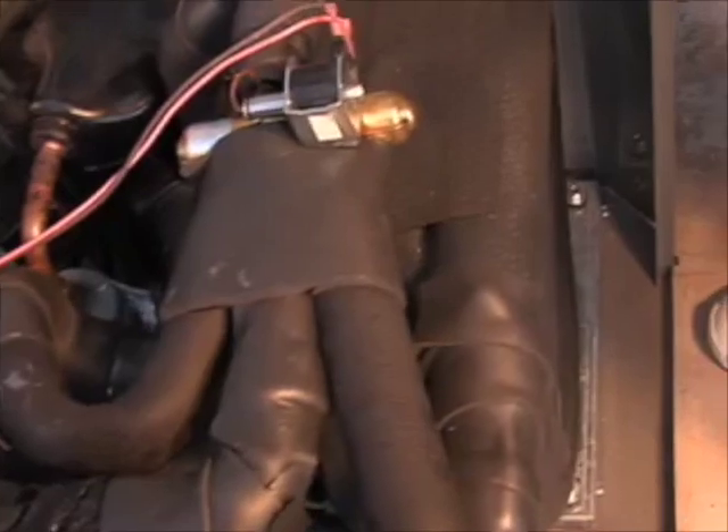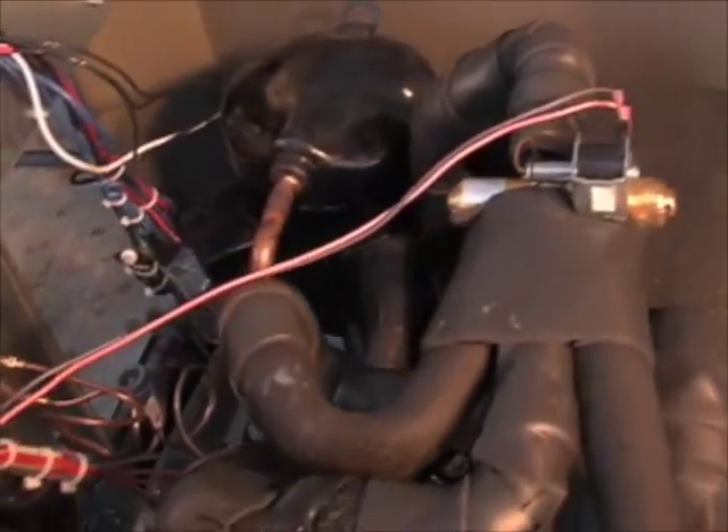We've completed the installation and finished wrapping insulation around all the component parts that might sweat, including all the refrigerant tubing. Now we're ready to reassemble the cabinet, but more importantly it's time to flush the coaxial heat exchanger — remember we drained the fluid out to replace it, so it's only full of air at this point. We isolated the ground loop, so now you need to flush the coaxial heat exchanger. Please refer to our flushing video if you need further instructions.